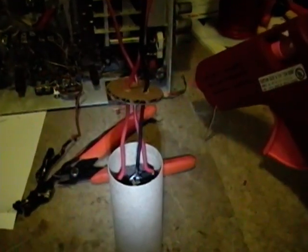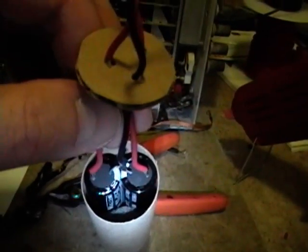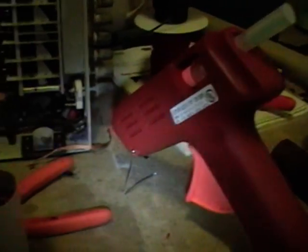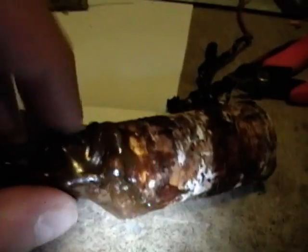Here we are a little bit further along in the process. What I did is I soldered the two caps together and built up a little shim of cardboard inside there and put some foam on either side to hold them in place. Then I made another little end plate out of a piece of corrugated cardboard, poked three holes through it, and ran the leads through it. I'm going to slide this down, glue it in place with the hot glue gun, and then take a little bit of this old taffy-like tar, break off a chunk, and melt it around to seal it so it'll look like the old wax did. And then that's ready for painting.